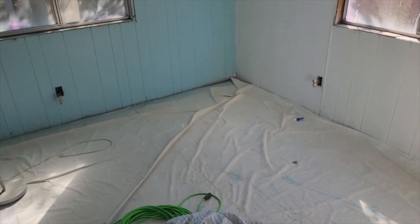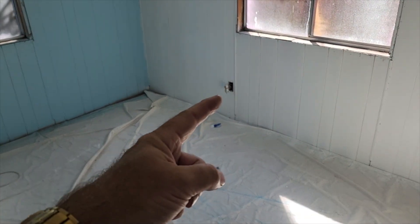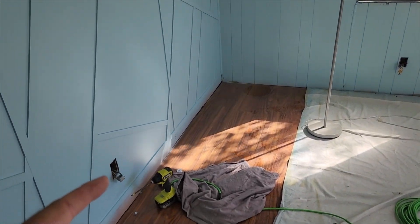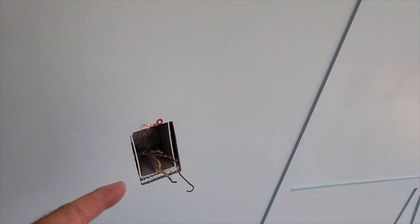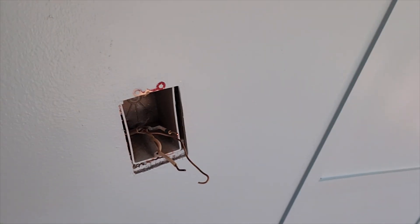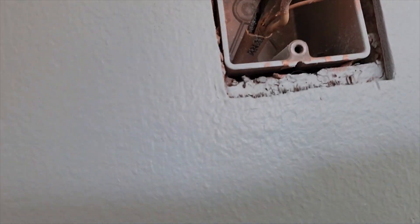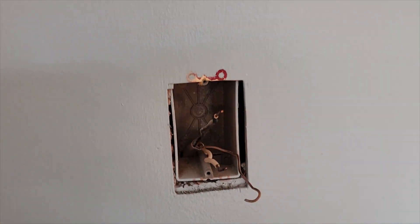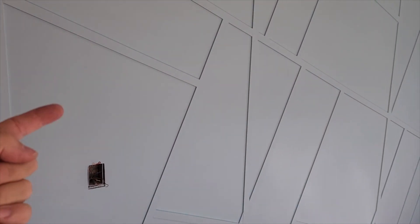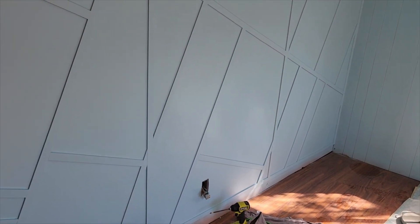Here's what I found: electricity comes in to this box, travels around the corner to the next box, around the corner to the next box, and then comes up to here. So this is a standard hot and neutral. At one time there was probably another wire but I don't know where it left this box and went. The solution for now is we're going to have to put sconce lights on this wall so that when they come in they can flip this light switch and a light will come on to illuminate the room. This is the headboard wall so that will work out, but I'm going to have to figure this one out.